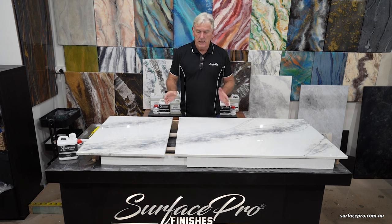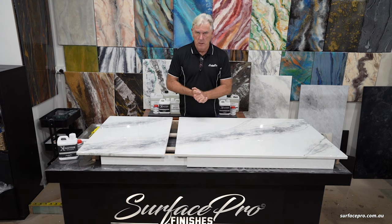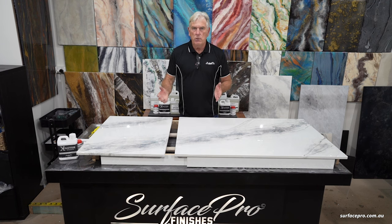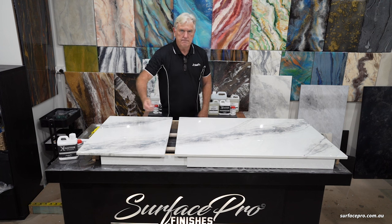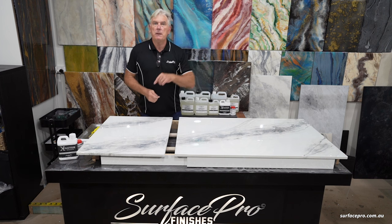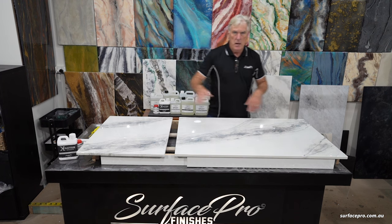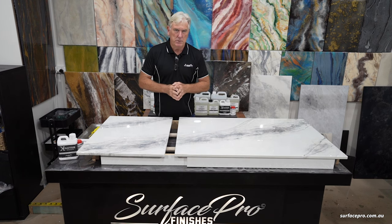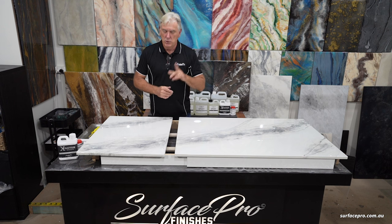Now, I'm doing this X-Factor by myself, and you could do that yourself also for this size. But when you're doing a kitchen countertop, when you're looking at something like 4 or 5 square meters, which is like 80 to 100 square feet, you need help. You cannot do it on your own. You need someone to be rolling out the wet, getting a thorough coverage, then coming back, as I said, that final pass with the wet roller, and then someone's coming behind you with the dry roller, backing you up, following you along as you work your way across and around the entire surface of your kitchen. That is most important. Please do not attempt to do it yourself. You won't be able to get the finish that you want to achieve by doing it yourself.